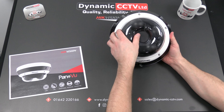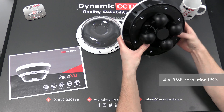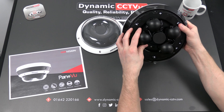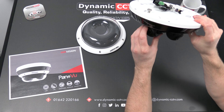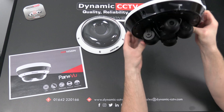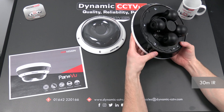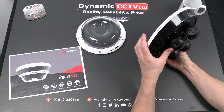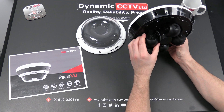This particular unit has four 5-megapixel cameras incorporated into it. Each one can be moved around on a pan swivel base which allows you to set each independent position of the camera. Cameras also have a tilt angle of approximately 10 degrees down to 90 degrees. The unit has 30-meter infrared, uses three EXIR infrared LEDs which are fitted behind this anti-reflective covering here, and each camera module has a 2.8 to 8mm varifocal lens which is also equipped with a semi-auto back focus mechanism.